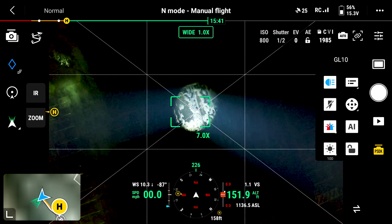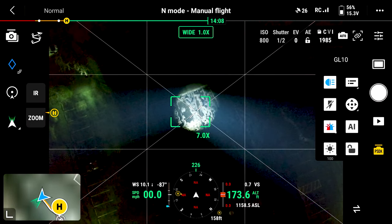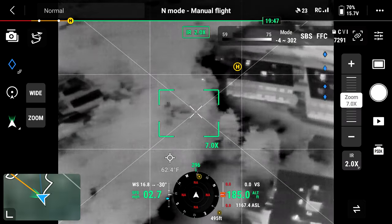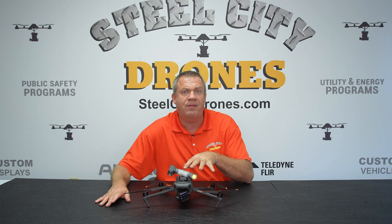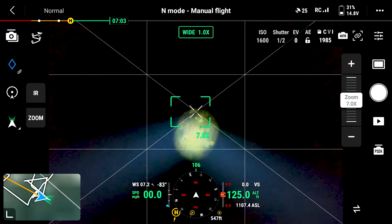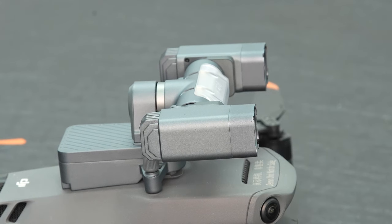As we go up to 150 feet high, it's bright enough to be very effective. Overall, the effectiveness range in my opinion is around 200 feet high. You also have to take into account that the thermal camera is not that effective at 300 to 400 feet high with a resolution of 640 by 512 with digital zoom only. So I think this light is engineered well for the specs and thermal camera limitations. From an overall design standpoint, the compromise has been well balanced between the size and weight of the payload limitations versus what is effective for normal operations.